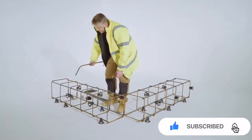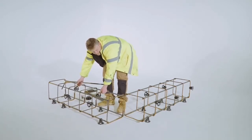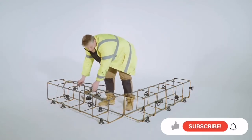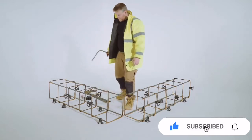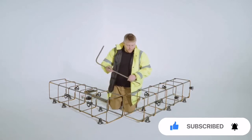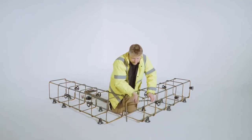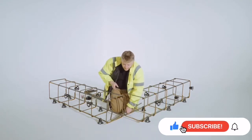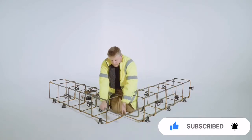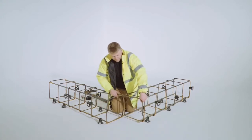Okay, so here we have a corner section. You'll see that we haven't pushed this right into the corner. The way we're going to do this is that we're going to have the corner like that, and we're going to create this corner of reinforcement with 8 L bars, and to do that we're going to use an L bar here, here, here, here, and exactly the same here, here, and that'll be your 8 bars.